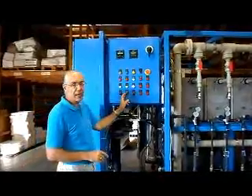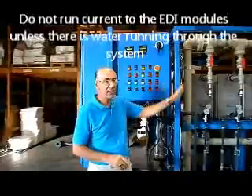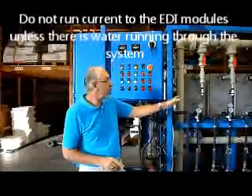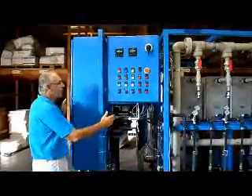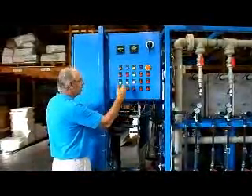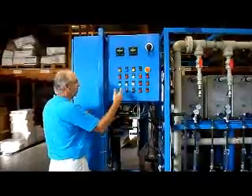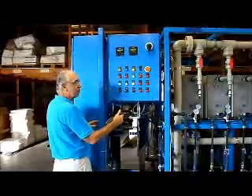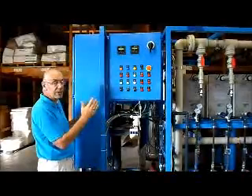So if for some reason you have the feed pump on and the green light doesn't come on, it's more than likely because there's no water in the RO permeate tank. The EDI system only worries about whether the EDI product tank is full or not. But the pump needs to have water in the permeate tank before it can run. If the pump doesn't run, the EDI system does not run. We do not want the modules to have DC power if there's no water flowing through the module — the two have to work in tandem. The system has to be energized and the pump has to be on for the system to work properly. If the pump is not on, the system will stop. If the system is not on, the pump will not run.